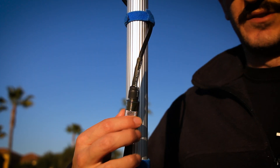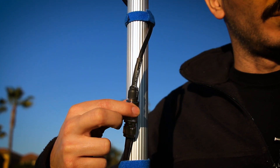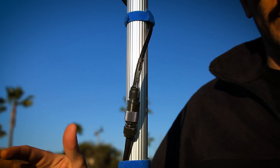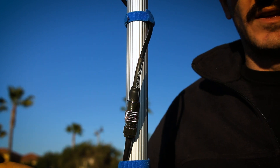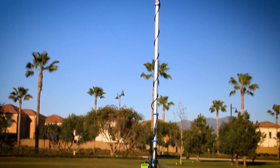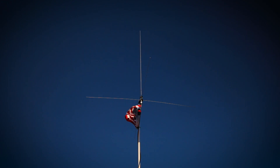Working our way up the pole, I have a 12-foot piece of RG8X coax made in the USA with Amphenol PL259 connectors. These are high quality connectors — you always want to use the highest quality coax and connectors possible to decrease decibel loss. Under 25 feet you're not going to have any issues, but anything over 50 feet you need to consider a higher-grade coax cable. You can see the coax going up the painter's pole, with the flag flying at the top, the 22-inch radials, and the VHF whip antenna.